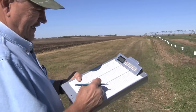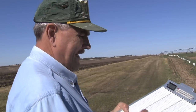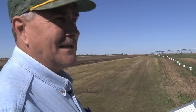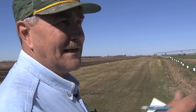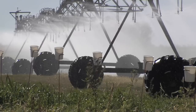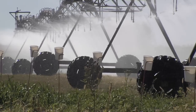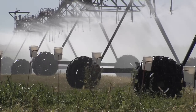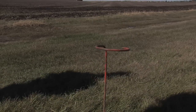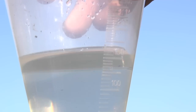In this last set here, we're measuring up to between 165 to 190, and then going back down again. Just by looking at this, right in that area there's about a 70- or 80-foot length where it's over-irrigating. This is information that a farmer could gather himself by just putting cans out here and having it run over. We're looking for all these cans to end up around 125 to 135, but some of them are reading over that.